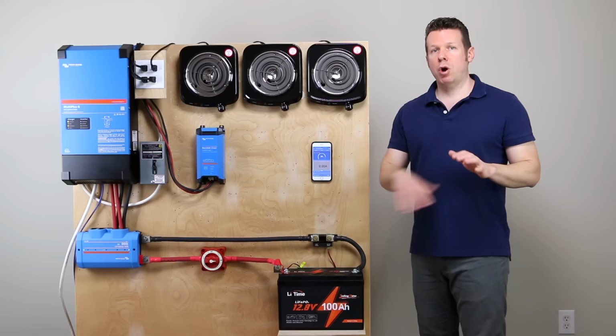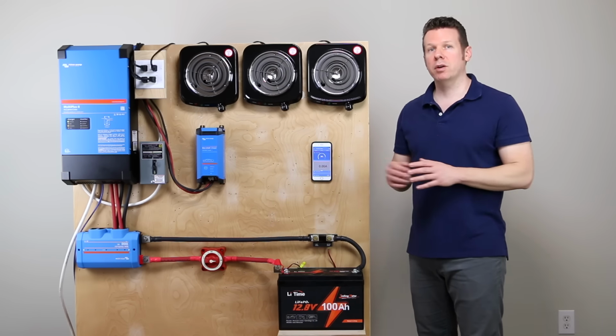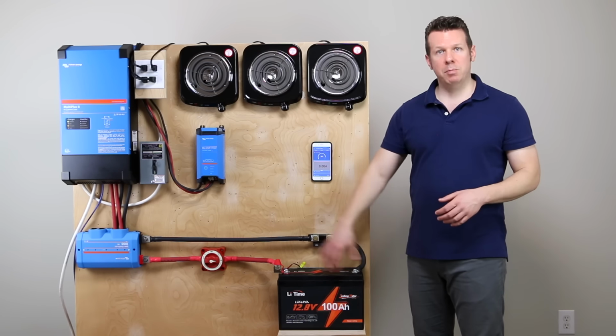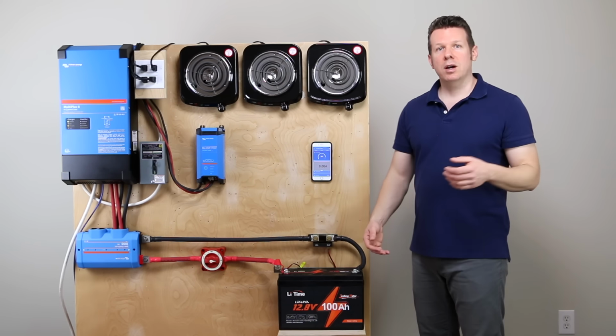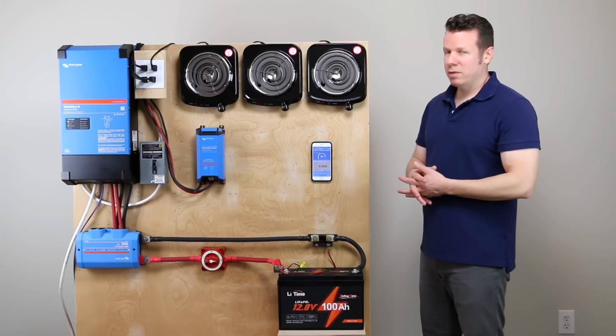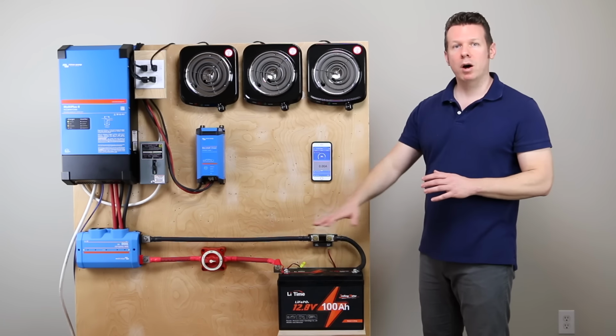Now, as far as charging, when the battery warms up to 41 Fahrenheit or 5 degrees Celsius, it should accept a charge again. So as it heats up here in the ambient air, if I just left it as is, it's going to heat up because it's way above freezing in this room. So eventually it would hit 41 and accept a charge again, and that's all automated.